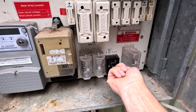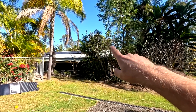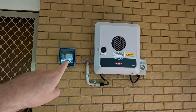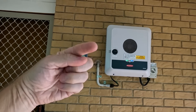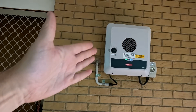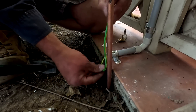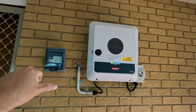I'm turning off the whole property now — main switch off. We are 100% off-grid just for the moment. The electrician basically took the whole grid-connected solar system off the internal sub-panel and connected it to its own load center on the outside of the building. From the main switch we go directly into this new load center — active and neutral — and from there it goes back into the switchboard near the garage. It needs its own earth stake too, and there's a brand new one installed. Grid-connected solar is completely separate from the house electrics.